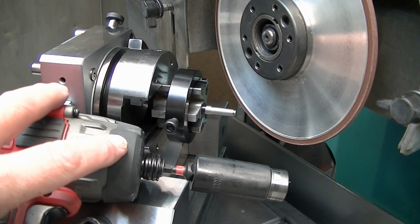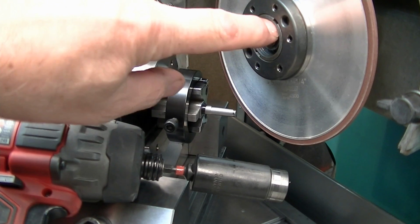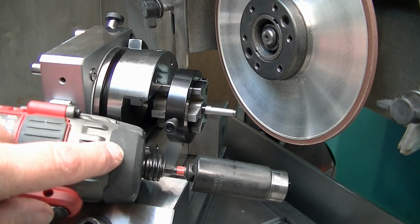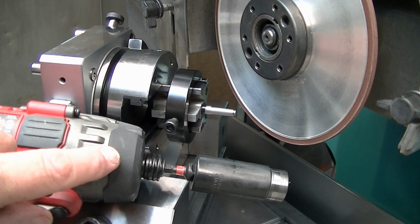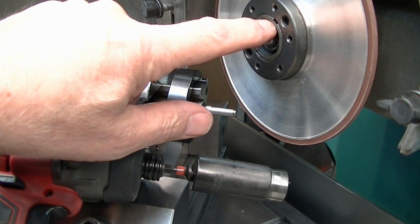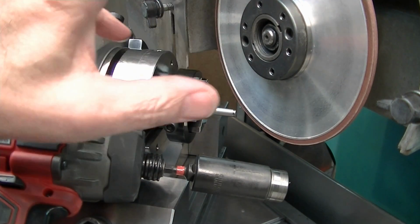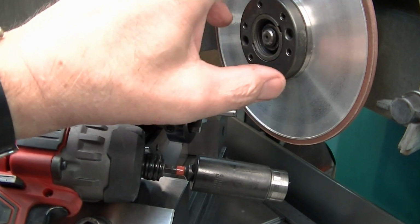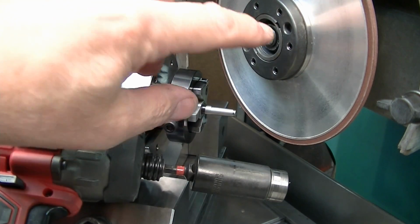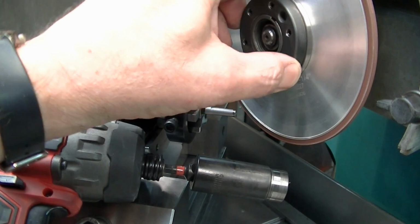I know I could get a lot of flack for this, but in my opinion, the best way to tighten the spindle nut on the surface grinder is with an impact wrench. Obviously, you want to use judgment in how tight you do it, but keep in mind the impact wrench puts pure torsional impact on this. No side loads to the bearings. It's all inertial, and the rotor of the motor of the spindle is what keeps everything from moving. So anything you do with a wrench, leaning on it, whatever, tapping on a wrench, puts impact loads on the bearing.